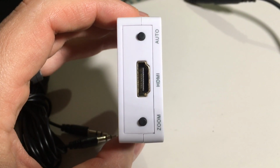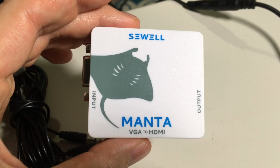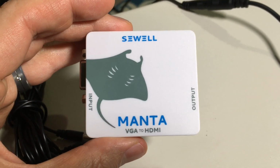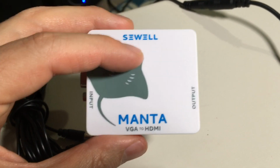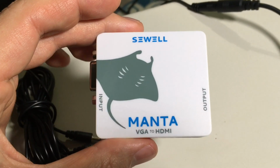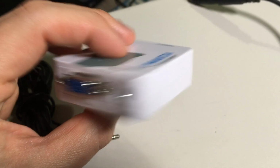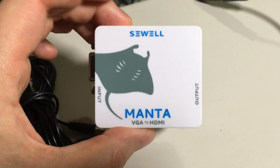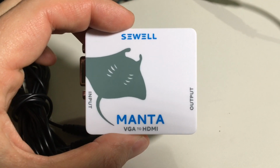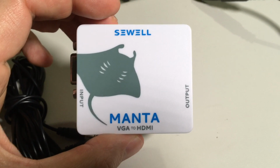Maybe with some extraordinarily expensive conversion hardware there is a possibility, but from my understanding right now, the FrameMeister, which I do have, does not do anything with VGA signal directly. You need some extra converter boxes, which would end up giving you something like this anyway. And the OSSC, the open source scan converter, also doesn't properly handle those signals. I haven't tested the OSSC, but I plan on purchasing one to see eventually. From what other members of the FrameMeister and OSSC club on the Facebook group have told me, it does not work just plugging directly in from a DOS PC.